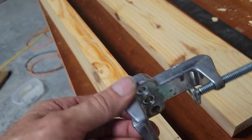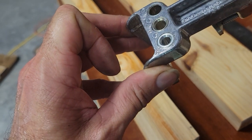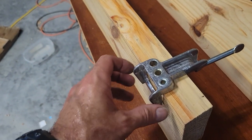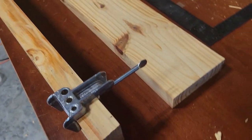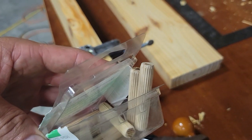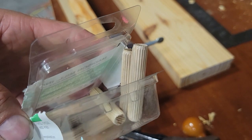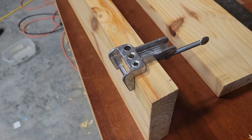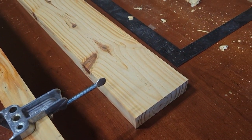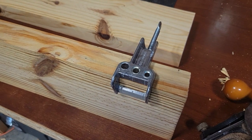It's a real simple thing — they're pretty cheap. You just need three-eighths, five-sixteenths, and quarter-inch dowels. It just clamps onto the side of the piece, and you drill the hole and put the dowels in. I would recommend buying them rather than making them because I like the fluting that's on these dowels. That allows the glue to go into those crevices and nooks and crannies, helping them slide in a little bit better but also have glue all the way around them. These are pretty cheap at Lowe's or Home Depot. I'll plane these out, get the edges perfect — it's basically a trial and error process — and once that looks good, we'll drill our dowel holes.